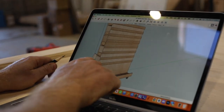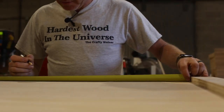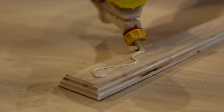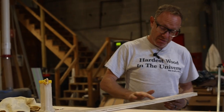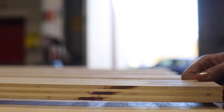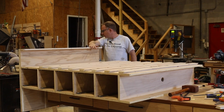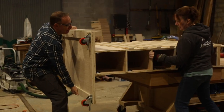French cleats — one, two, three, four, five, six, seven, eight... six, twelve, eighteen, twenty-four. Titebond 3 has a holding power of 4,000 pounds per square inch. All that's left are the dividers on the other side at the drawer. We can just slide it to the edge and then tilt it slowly over.